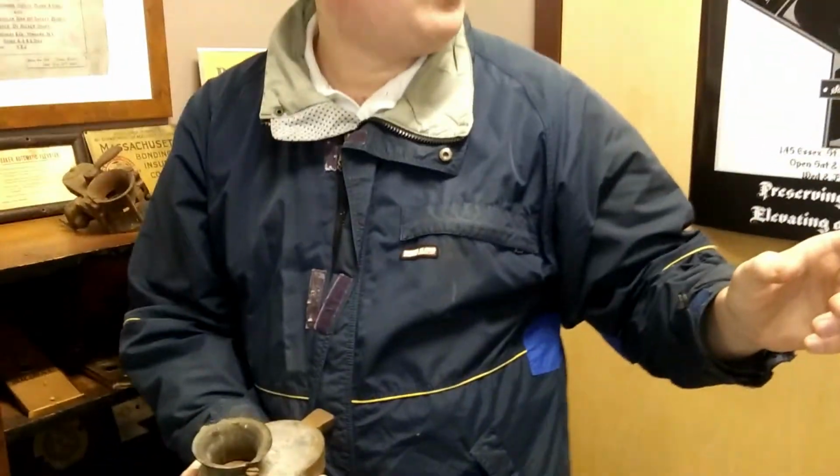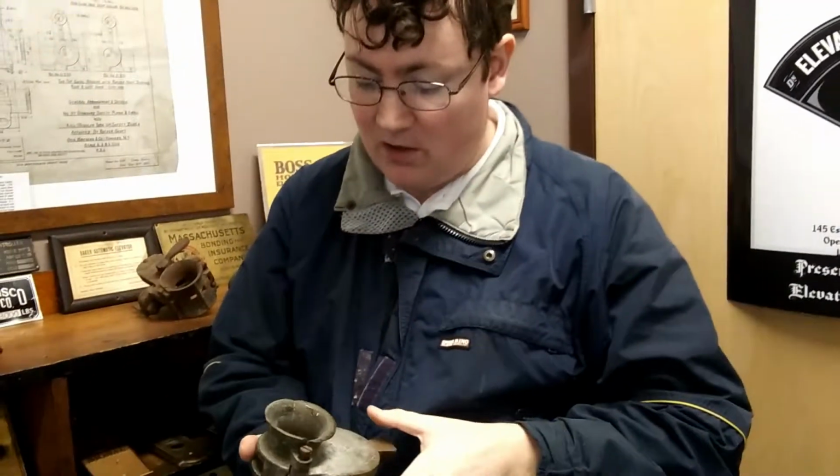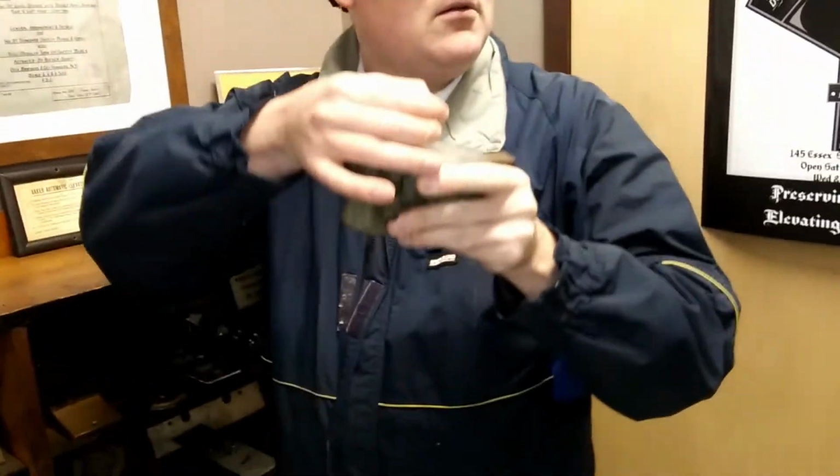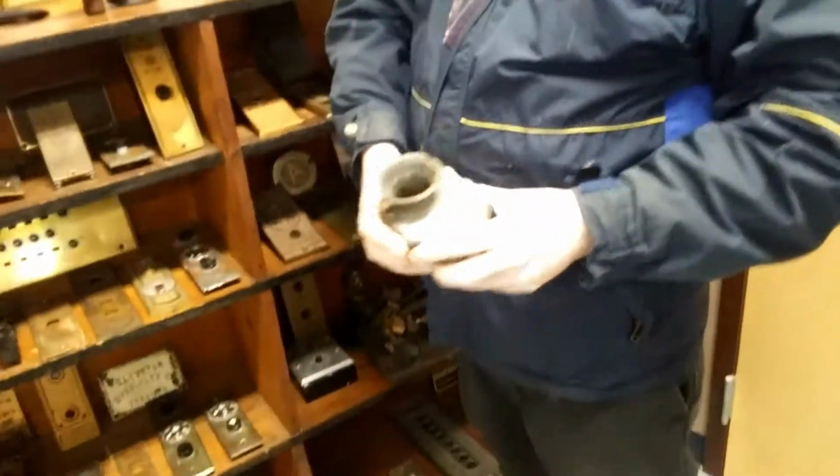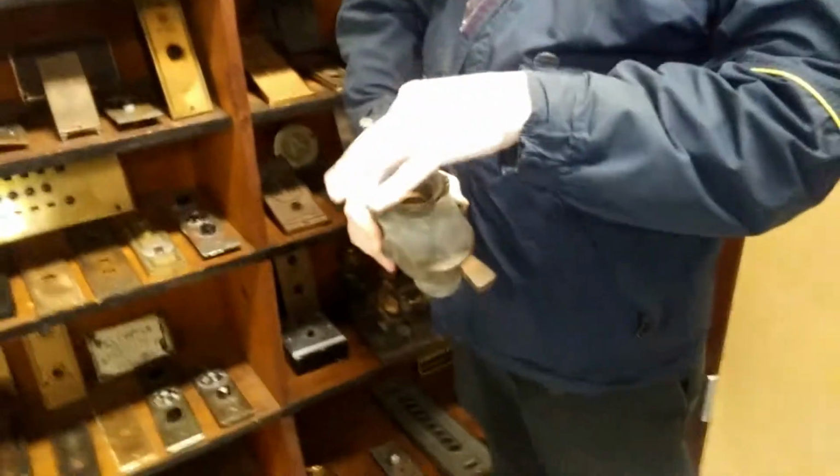So the bead acts like a brake, sort of? Well, when you move the rope, you turn a switch up top. And you always pull it the opposite direction you want to go because they use the movement of the elevator to shut it off. But when it gets to the very top, it's a really big bead. The elevator hits it, pulls the rope, and then it pulls the switch to off. But if there's multiple floors, when you're getting near the floor, you just go like this, and they'll catch one of the smaller beads, and then they'll pull the rope and stop. Oh, I see.